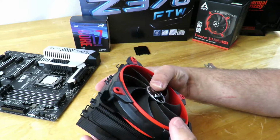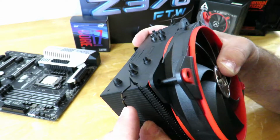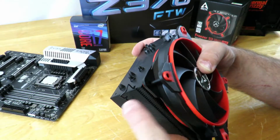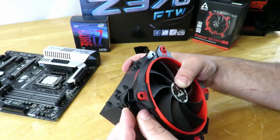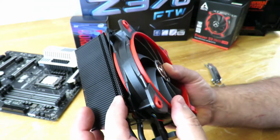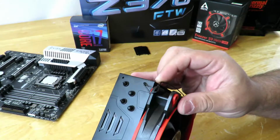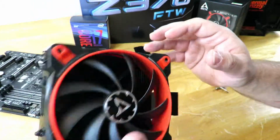And now what you're going to do is, you'll notice there's a little carving, I would say, a little notch right here and down here on this little wire that you've installed. That's going to fall, well, not into this hole, but this hole back here on the CPU fan. So you just push it this way and then pull it a little bit and then listen to it. See how it snaps in place? Then we'll do that same thing right down here. Okay, snaps right in place. And then we'll repeat on this side. All right, pretty simple, right?